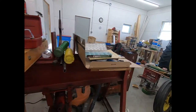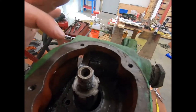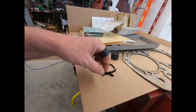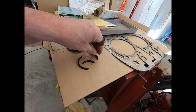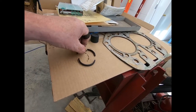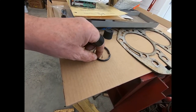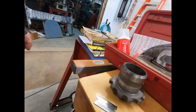So it's always leaked down this pedestal, as you can see. Now, I took it apart. The cork gasket in there was 119 thousandths thick. And it was broke, of course. You know, it had cracks in it. Whether this was my main leak or not, I don't know. Of course, by the time you pull that other piece out, you can break this awful easy because it's so brittle. So I don't really know if it was broke or not before we started. That I don't know.